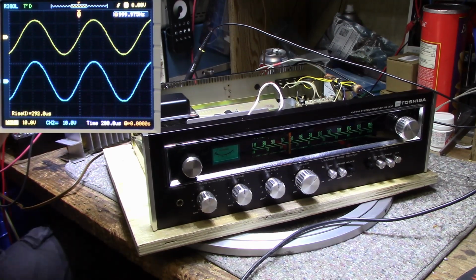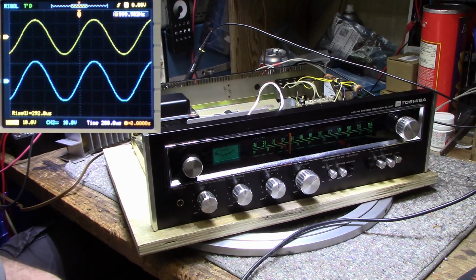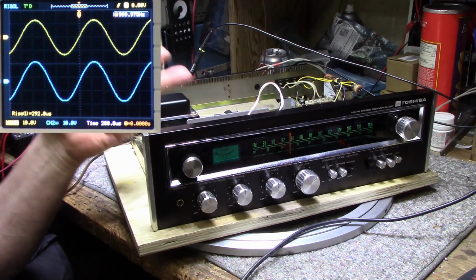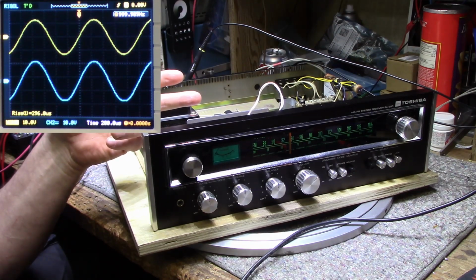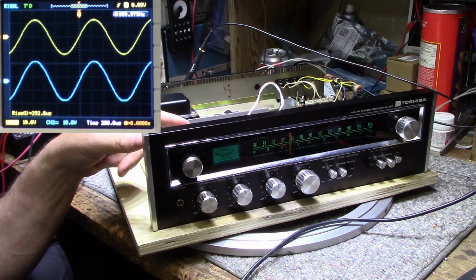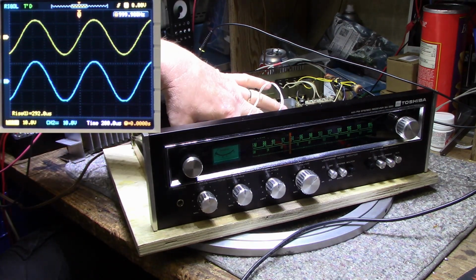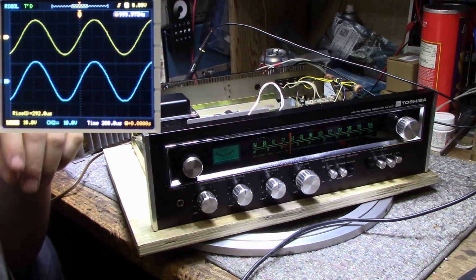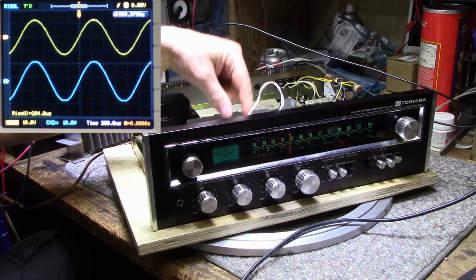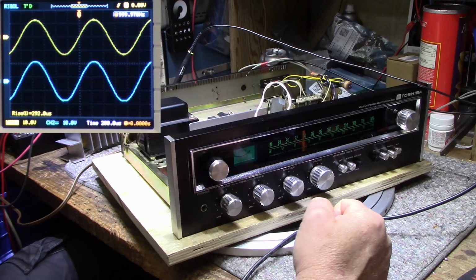I've got all new capacitors in the power amplifier, and there's really only 3 active components in each channel. There's the 2 output transistors, and then there's the driver chip. So if the signal going into the amplifier is balanced, there's got to be a gain mismatch in one of those chips, I believe. Let's see. I think they all have the same suffix. Yeah, they're -B. These little driver chips come in 3 different classifications for gain, and I was reading in the service manual, you have to match with the original. If you're replacing one of these, you have to match it to the other one, but for whatever reason, we're getting more gain out of one channel than the other, but it's not a big deal.